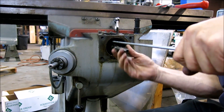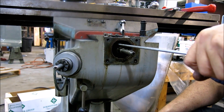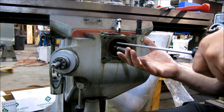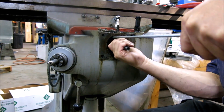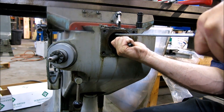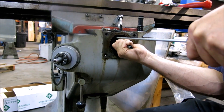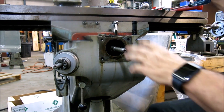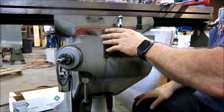To be honest, this machine's used — I'm going to end up tearing this thing completely apart to fix it — but you would follow the exact same procedure. Once you get it tight, you're going to want it to where it's relatively stiff but you can still turn it by hand. Once you get it into that position, you're going to reassemble everything and check your backlash.